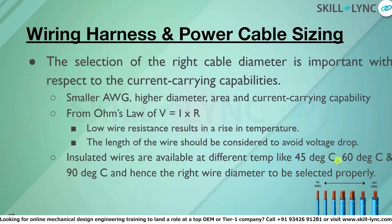The power cable must be selected so it can deliver 1C, 2C, 3C, or whatever current the pack needs to deliver for the designated time. For example, if the pack is designed to deliver 5C for 30 seconds, the power cable must also be able to deliver that without overheating, melting, or causing fire. Power cables can be copper or aluminium and can be evaluated using Ohm's law (V = IR). The wire's resistance must be kept low — higher resistance leads to increased temperature — and wire length should be chosen to avoid significant voltage drop.